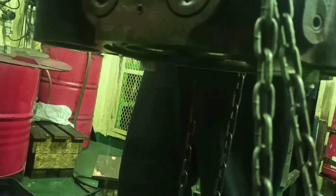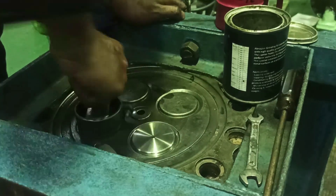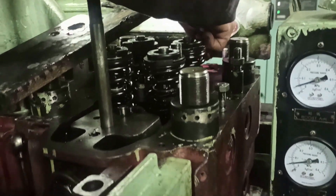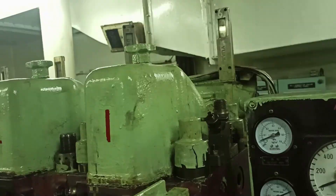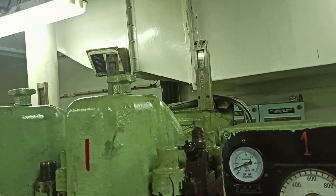Clean the parts and assemble, then install it in the cylinder block. After 24 hours, make an observation if there is water accumulation inside the cylinder. Air blow the engine — there is no more water inside the cylinder and we can service it now.